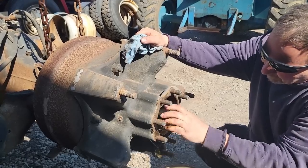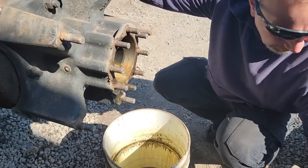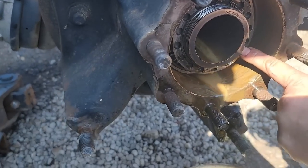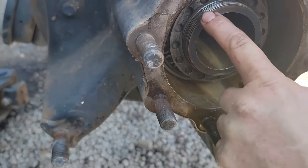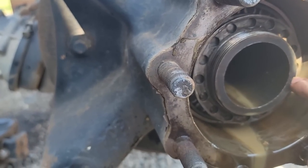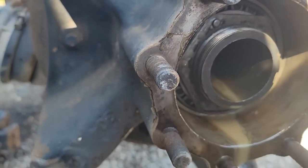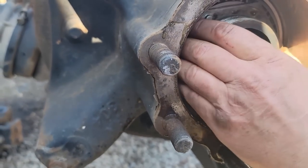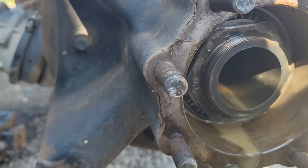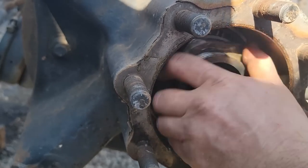So this is a lock nut. This goes over top of the lock plate. All right. So look in here, this is a lock plate. There's a keyway right here. And then there's a pin on the inside nut, so you can adjust it, and then this goes over it and attaches here, so that it locks that inner nut, which is what sets your bearing preload, how tight those inner and outer bearings are together and how much play they have.